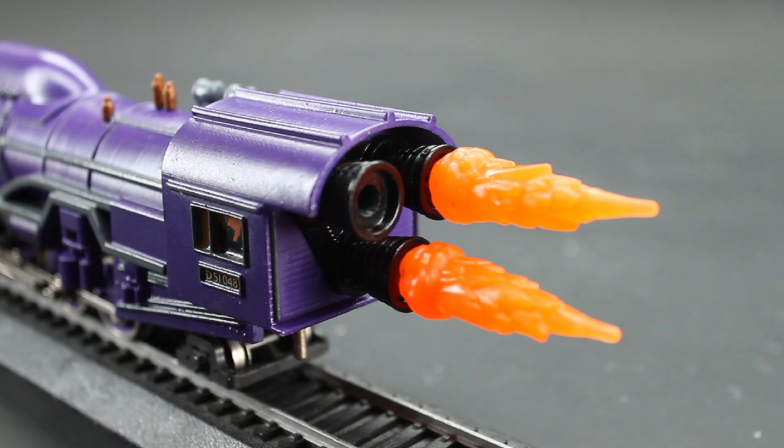So yeah, this was the project I've been working on — a not necessarily scale-accurate Astrotrain to fit within my HO scale alt modes collection. It can haul cargo wherever Megatron needs it, or race high-speed electric passenger trains. Astrotrain is rather a versatile locomotive. That said, is it perfect? No. One day I'd like to make a third attempt, preferably with a locomotive designed to run separate from the tender, as all the modifications I've made leave the model not really enjoying high speeds. The connections don't exactly connect the best way they could, and high speed creates conditions for micro-arcing, meaning lots of cleaning after a high-speed run. The LED lights also seem to flicker and aren't as bright as I'd hoped, so on the third attempt I'd like to install a capacitor to smooth out the current and reconfigure the wiring to make them brighter too.